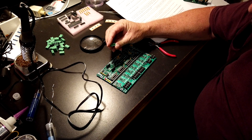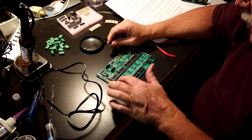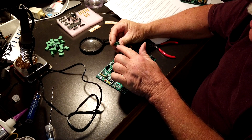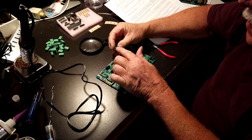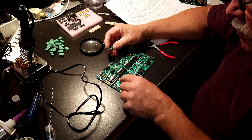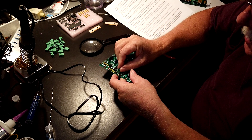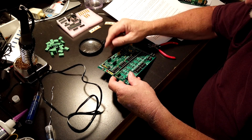Now the sockets for your wires go in. You've got 16 places down here to solder in. These little sockets have a T-bar right at the top — you want to put that at the top. You can see the little squares in here, so they just go in like that, and solder them down. Be right back.